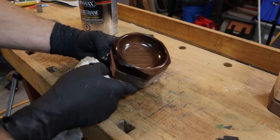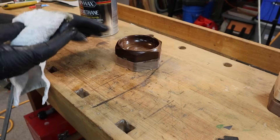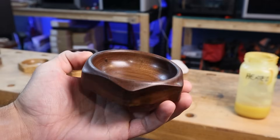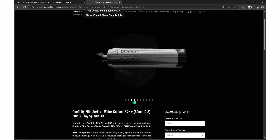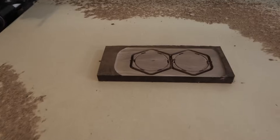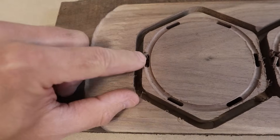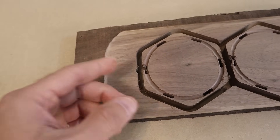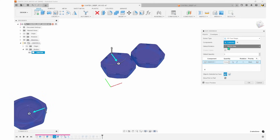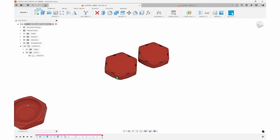Ideally two coats on the top and two coats on the bottom with a few hours to dry in between coats. I don't have any spray equipment at the moment so I'm just applying by hand. I have a little trick with these — since we have magnets I've made up a couple of little jigs which I can hold on to that allows me to apply to the top and bottom all at once, saving a little bit more time. For a production setup I would definitely set up a spray booth and use lacquer. With dedicated tooling, a better spindle, and an automatic tool changer I could save quite a bit of time and produce better results. I put it at about 30 minutes per piece of my time with my current equipment, but I can probably get it down to about 15 minutes per piece.